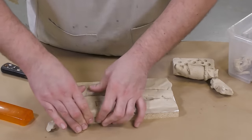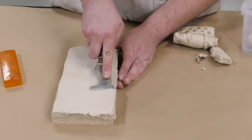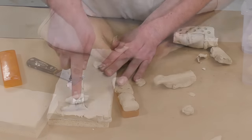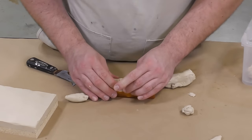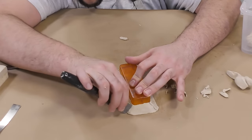The first step is to set up a bed of clay. I'm going to be using the sulfur-free Sculptex soft clay and I'm going to work that clay until it's nice and even, and then separately I'm going to build up a bed or pedestal of clay that my turn signal is going to sit on.